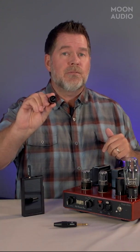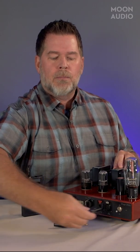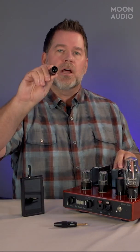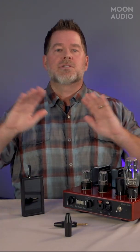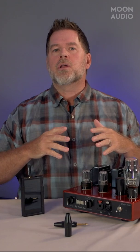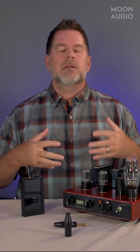Now in situations with a four-pin XLR, where all of the pins are separated, when you push it in or pull it out, there's only one single tab in each situation on the four pins that is contacting, and we don't have this issue. I would still suggest, even when un-jacking your balanced headphones, just to be safe because there is an electrical current going on. You have a sharp break in that current. Especially with tubes, you can have a rush of current in the tube and maybe get some kind of noise issue.